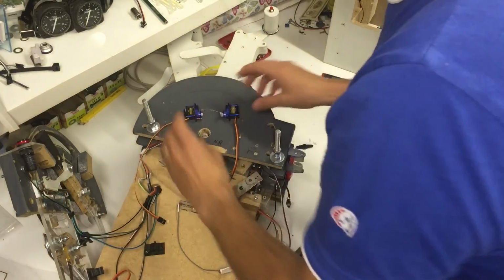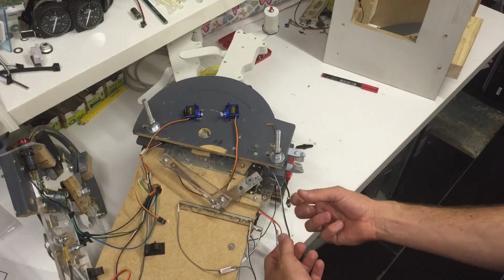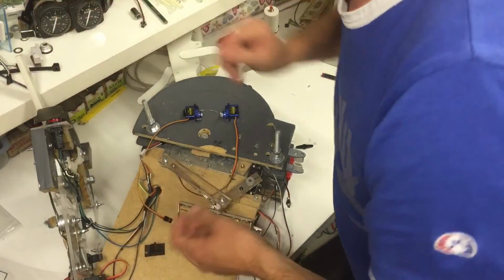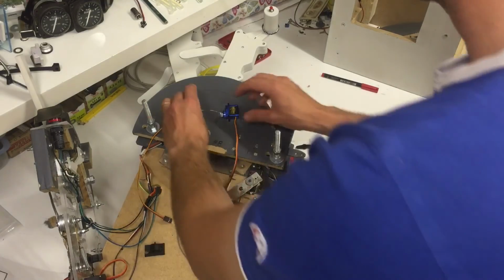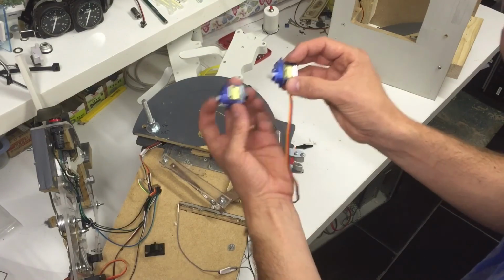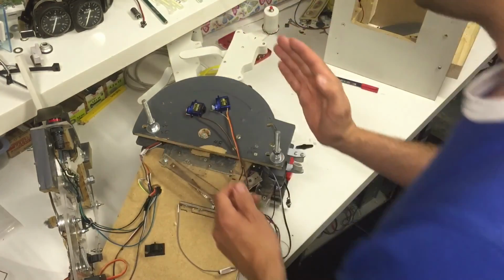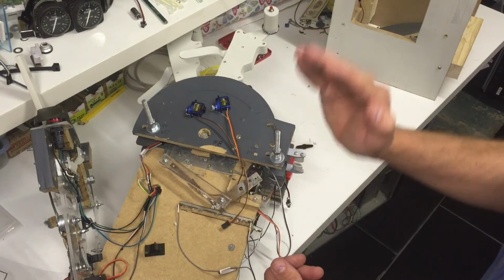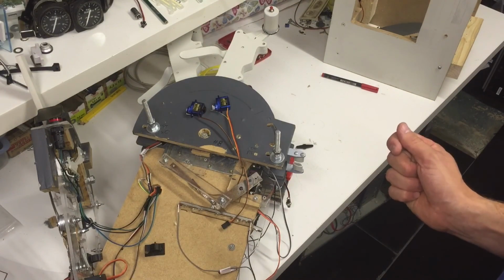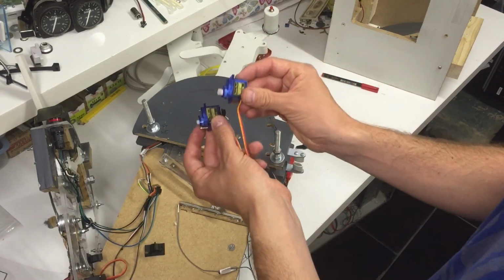So what you need to do is, and I had to redesign it down here and move this servo the other way around. Early on, it was placed here in this hole. No longer. Now it's placed the other way around, so that they're actually placed like this. First officer's side, or handle number 2, handle number 1. Okay, and make sure when you mount the servos that the minimum position of the servo is the idle on the handles here. Otherwise, you'll get into trouble as well. So that's the most important thing here. Servos, the same way, minimum equals idle.